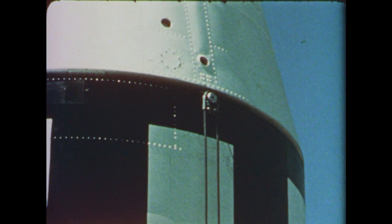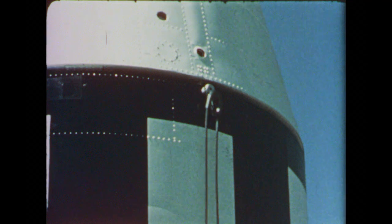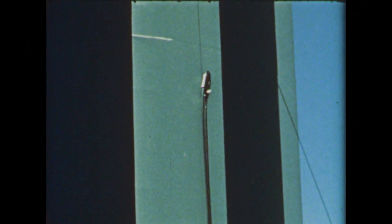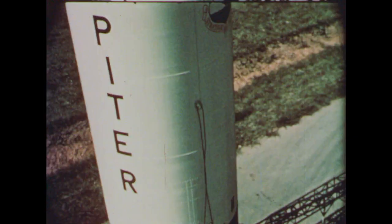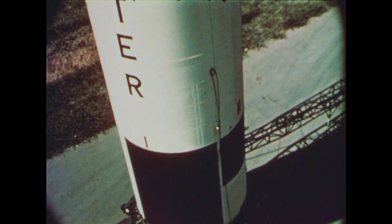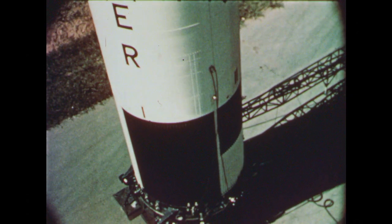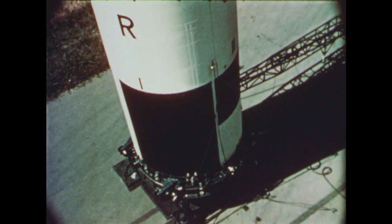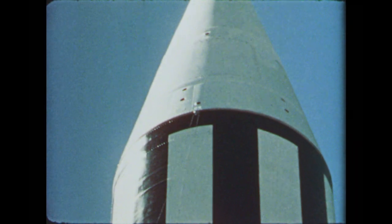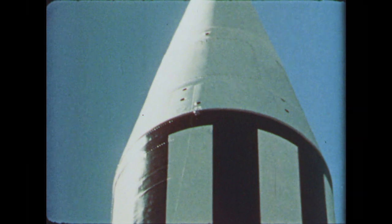The missile end of the sling is permanently fitted with a keyhole plate. Pulling on the release cable from the ground raises the plate, which then slips off the erection bolt quickly and easily. A crew member feeds the release cable through the groove and the sling is lowered. Damage to the missile is prevented by controlling the release cable's rate of descent. This tactical concept of the Jupiter mobile erection equipment is characterized by simplicity of design and ease of handling. The system is completely mobile, all parts are basic, and assembly is rapid.